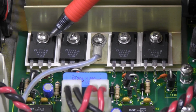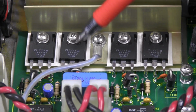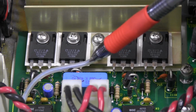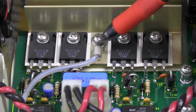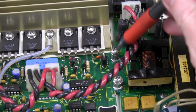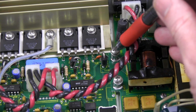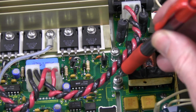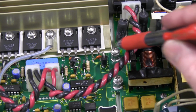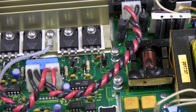And these four devices are high voltage, high current N-channel MOSFETs. They're IRFP460s, and you can see we've got some temperature sensing coming off here as well in exactly the same crimp configuration that we had for our mains input. And take a look at this. You'll notice these screws here, it's an interesting method to join this board through to this board. They've actually got these big screw studs here, which are the high current interface connector between these two boards like this.